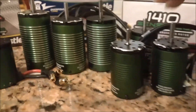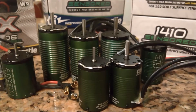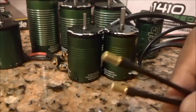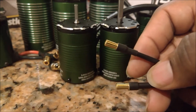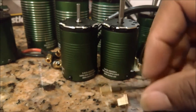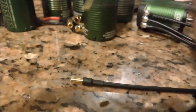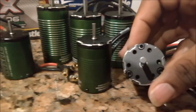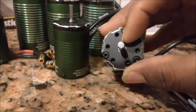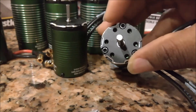So what is a sensored motor? Brushless motors are unique. For a standard brushed motor, you only have two cables - you apply positive or negative polarity and the motor spins clockwise or counter-clockwise. Brushless motors are different because they have three wires. Inside the motor you have a rotor - these are four-pole motors - with a circular magnet having two north and two south poles, plus a set of coils.